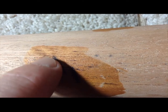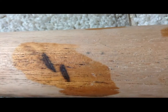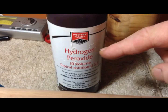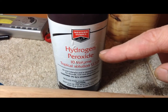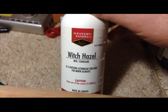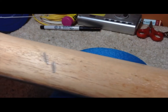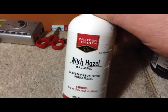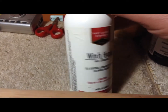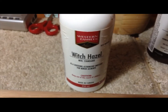These are really heavy duty maple necks. I've used just bleach and it works fantastically but that's probably gonna be too much on this thing. So I started fading with hydrogen peroxide, but then I remembered this summer I was reading about removing burn marks when people are cutting pine and stuff, and they suggested witch hazel. Which kind of makes sense - it's an astringent. So this is a combination of witch hazel and hydrogen peroxide. I think this did more, so I'm gonna try this by itself next time.